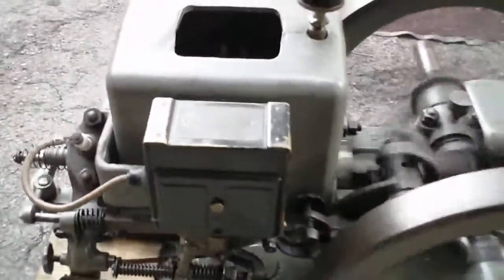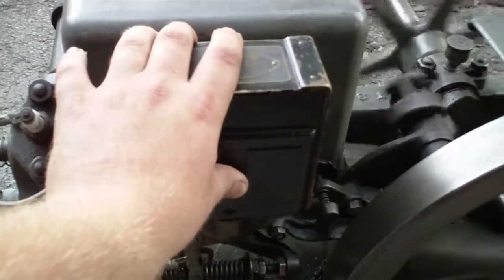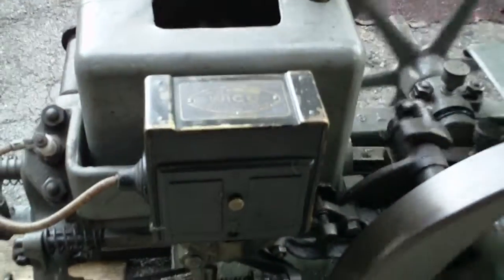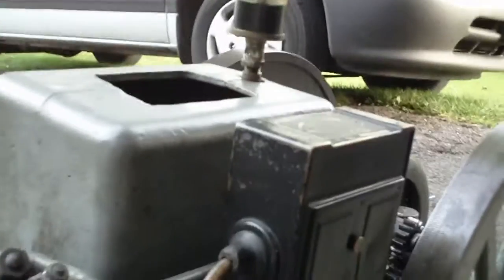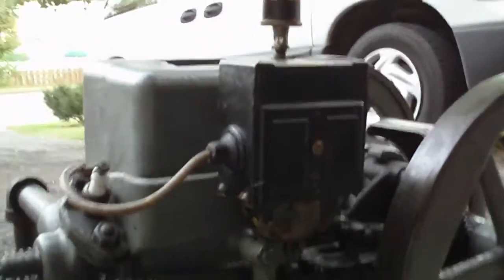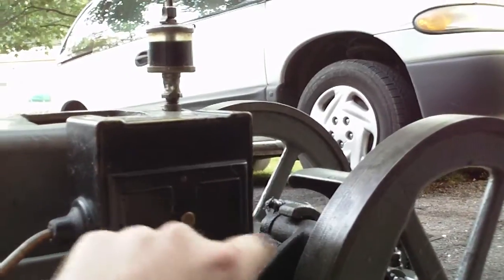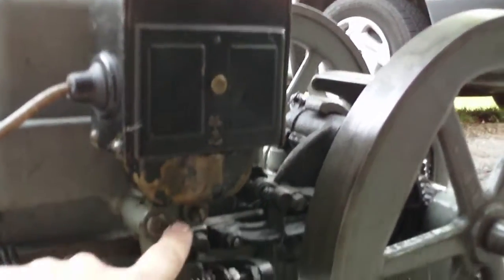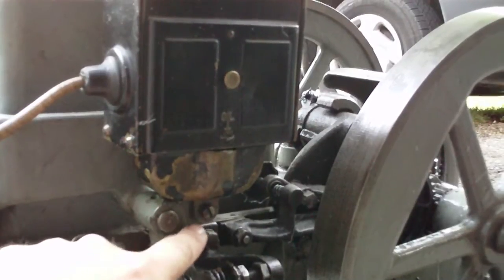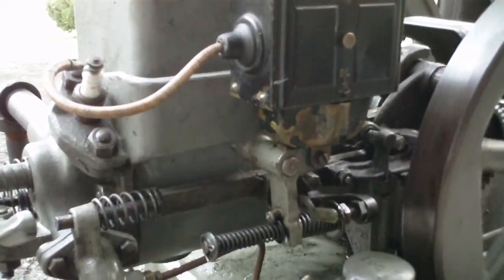This is of course a gasoline engine. I'm going to press the stop button and as I press that stop button the engine will come to a stop. What we're going to look at today is this little black box that I press the button on — that is the magneto. Inside this black box there are two large coils on each side, wrapped around steel or iron posts. On the bottom there is a horseshoe magnet that is pulled down away from those coils at the correct time in the engine stroke by this little arm here moving — you can see that arm moves and pulls that off, and it clicks.